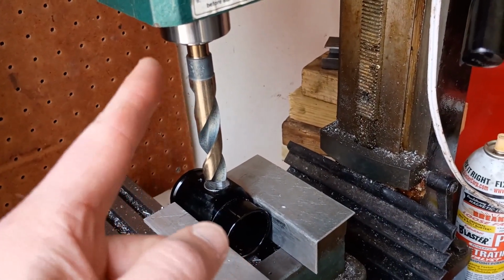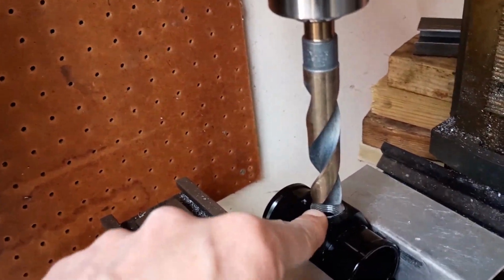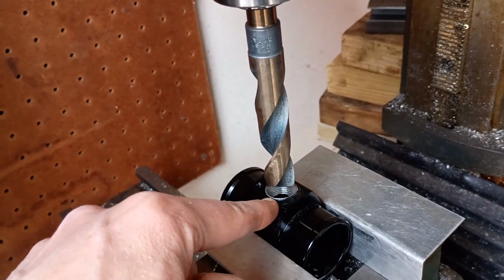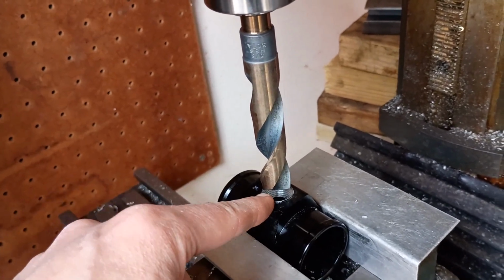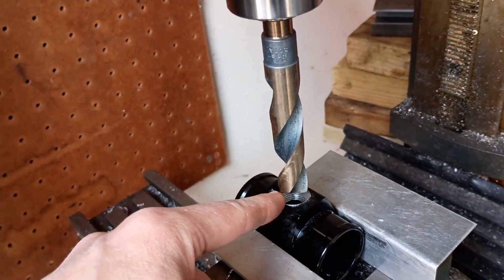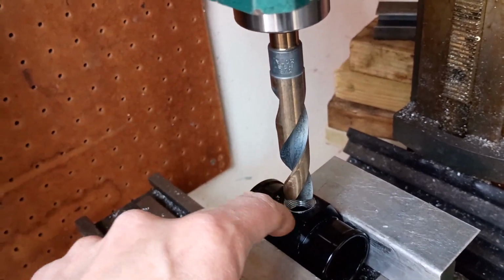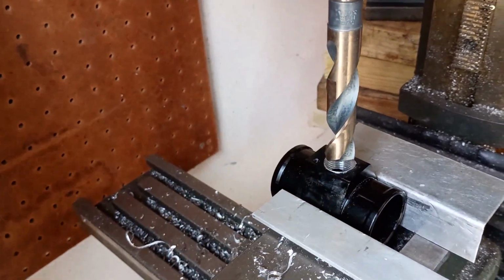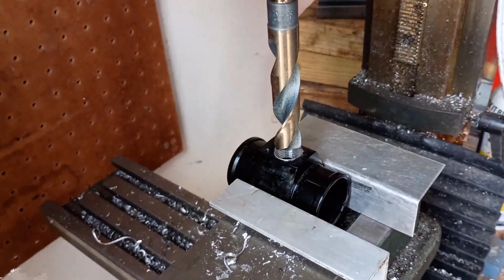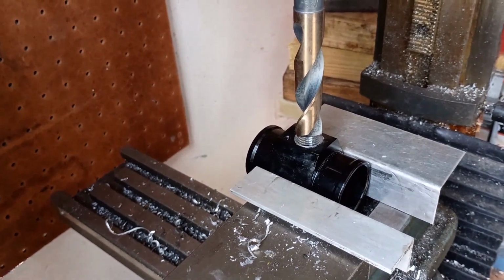All right, I broke down and drove clear over to the other side of town to get a 5/8 reduced shank drill bit from Home Depot, because no matter what I tried, every time I felt like I was making progress, whenever I would thread this switch in there, it would get one thread going and then just stop. And whenever I tried to force it past, it just pulled that top thread out. So 5/8 is the next size up. I'm going to run this through, run the tap through it again, and hopefully that'll be the end of this. This is becoming an all-day project.